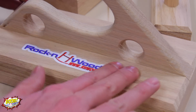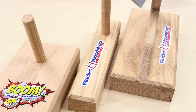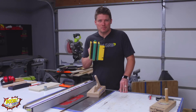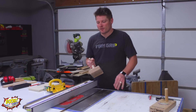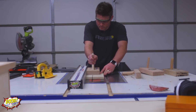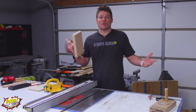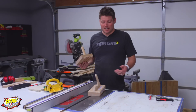I know what you must be thinking — why go through all the trouble to make a push stick like this when I already have this orange one with the grippy bottom or this micro jig? If you've ever owned something like that, you always have to make sure it goes between the blade and the fence, or take extra time to preset it before going over the blade so you don't cut it up. With something that has a sacrificial bottom like this, if you're in the middle of a cut and realize you forgot to set it up, you don't have to worry. You just grab it, stick it on the wood, and push it through. Cutting the bottom is not going to make a bit of difference. When it gets too worn, you just throw it away and make a brand new one.